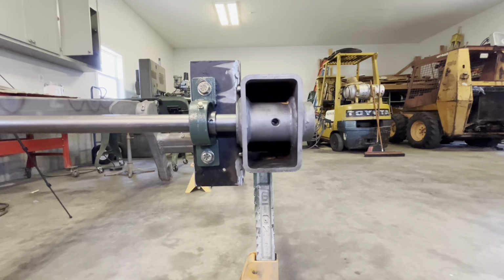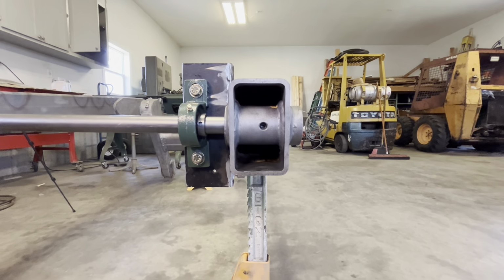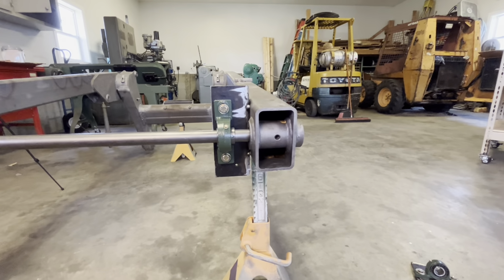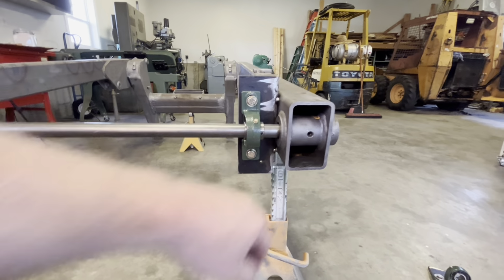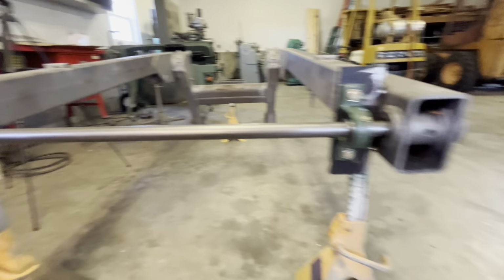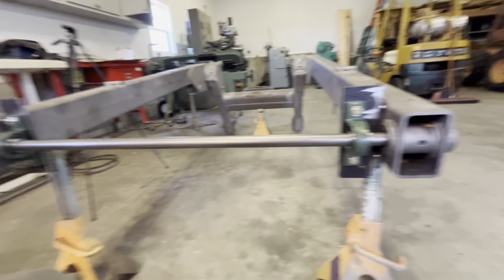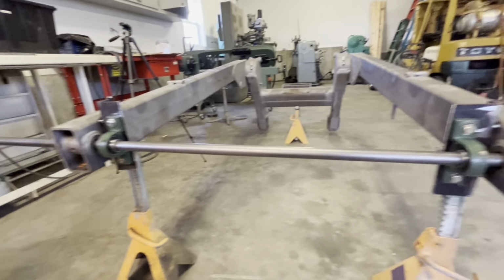And it kind of looks like maybe that bushing was welded in a little bit at an angle, and that the factory clearances on this boom are loose enough from the factory that it didn't matter. But what I think I'm gonna do is split the difference. Instead of aligning it perfectly off the center, I'm gonna fudge it a little bit the opposite way so it's not so far off. And then by the time I take my 50, 60 thousandths out, it'll basically even out.